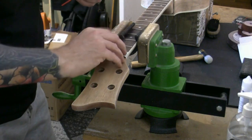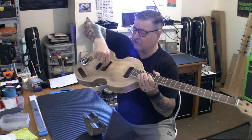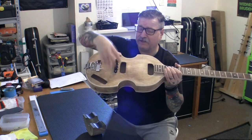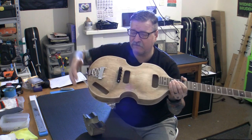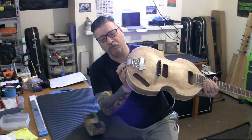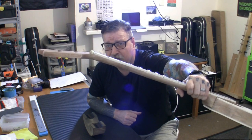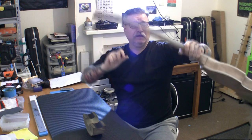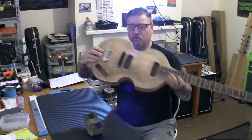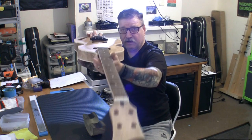The zero fret is in — all done. I skipped through some of the work; this is just a matter of getting the guitar secure and drilling two holes. We did get some splintering under the plywood top, but so did he when he cut those holes — I kind of expected it even though I did the tape underneath. But we are nice and tight, that is fixed. We also have the stop tailpiece on there, I added the strap pin because there was a hole for it, the zero fret is in, and the nut is glued in. Really really pleased — this has come out very well. It was not supposed to be ready until Tuesday, but here we are Saturday morning all ready to go. I've let Gary know it's ready.